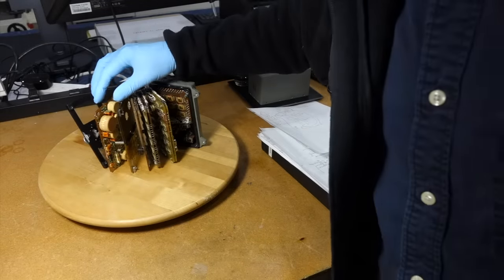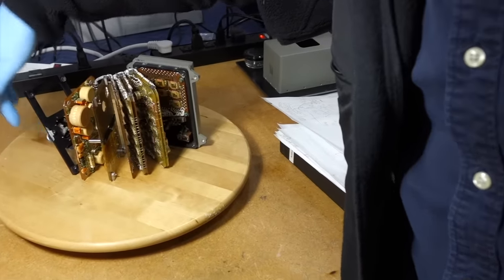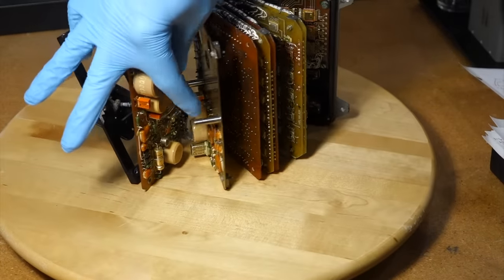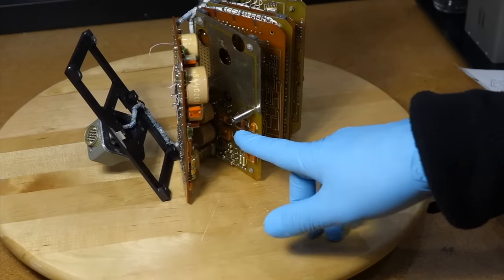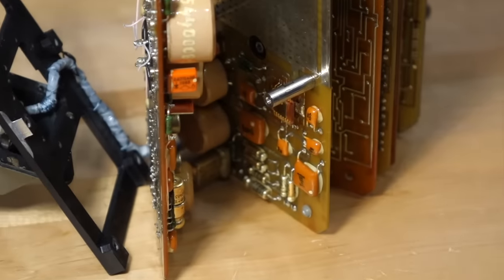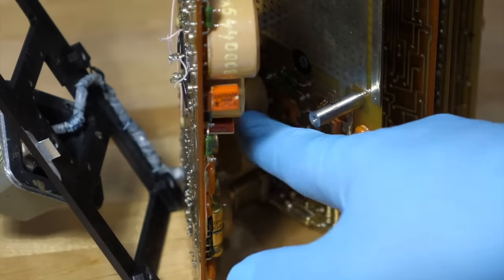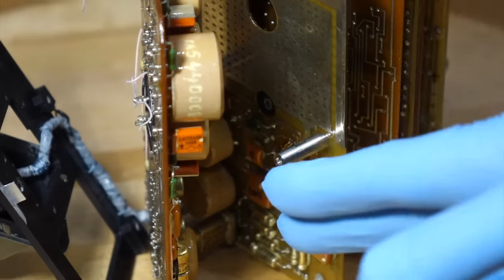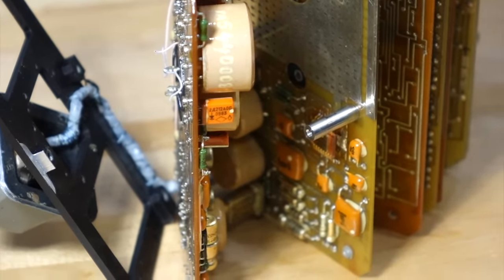So the power supply is these two boards here. We start with 24 volts coming in from the connector, which goes to the second board. The second board has this interesting pink integrated circuit, which is a fairly standard voltage regulator integrated circuit. It's producing 15 volt output. There's a bunch of filter capacitors and filter inductors. There's lots of filtering, right? I expect a lot of this is to prevent noise from the switching power supply from feeding back into the rest of the spacecraft.